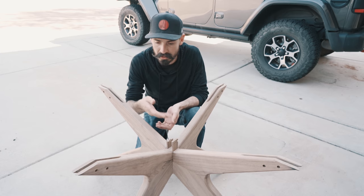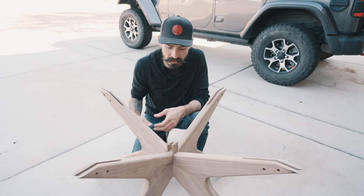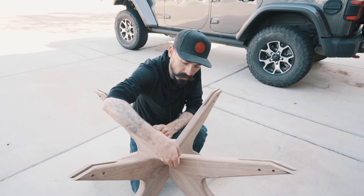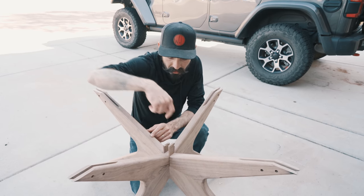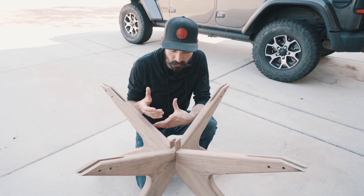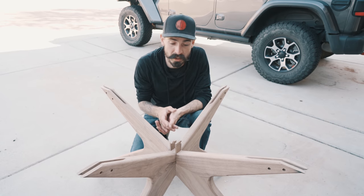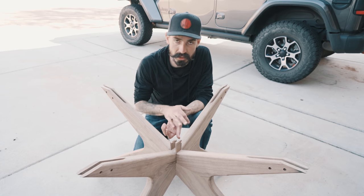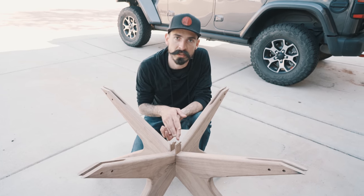It's never a permanent connection, because if I glue this up, you have issues: the grain runs this way, and you have end grain here, here, and here. So this joint is never going to be a great joint if we glue it up. We need to allow for movement. In our minds, this is an excellent solution to this problem. We're here today with Darren and he's going to work with us on creating a custom wedge piece for this.